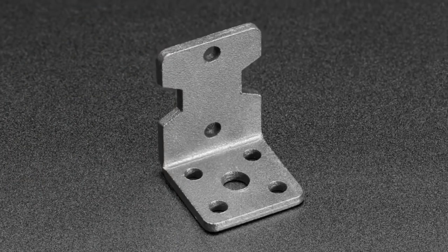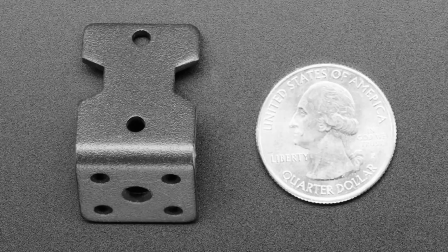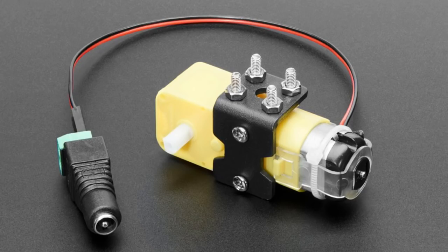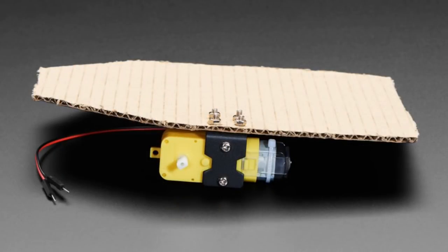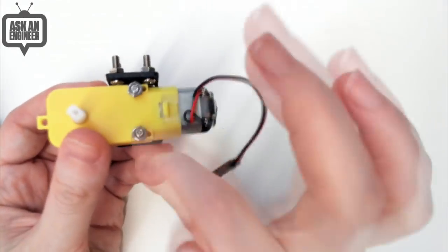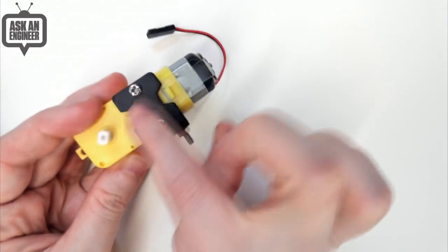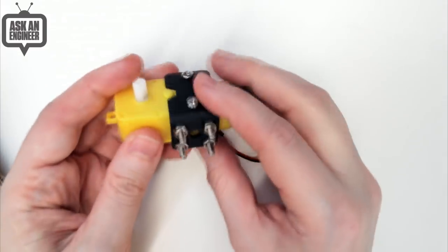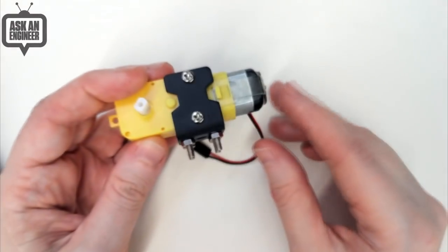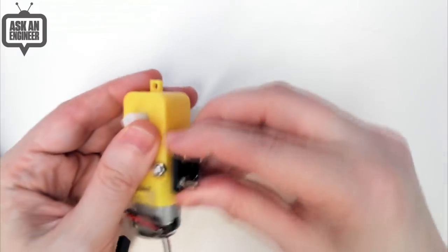Next: two pieces of metal. This piece of metal is for mounting our TT motors — these plastic gearbox motors. This piece of metal is just the perfect size and has holes, and it even comes with all the screws and nuts to attach it. Two long screws go through the body of the gearbox motor, then this piece connects and attaches quite strongly. You also get four M3 screws and nuts to attach to your plastic, metal, or cardboard chassis.